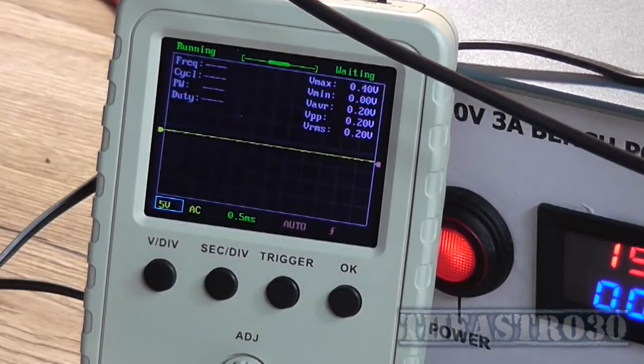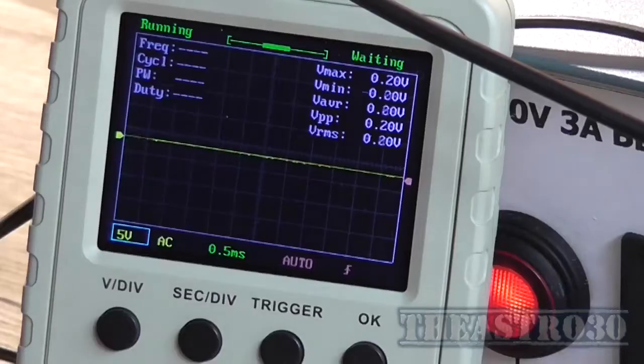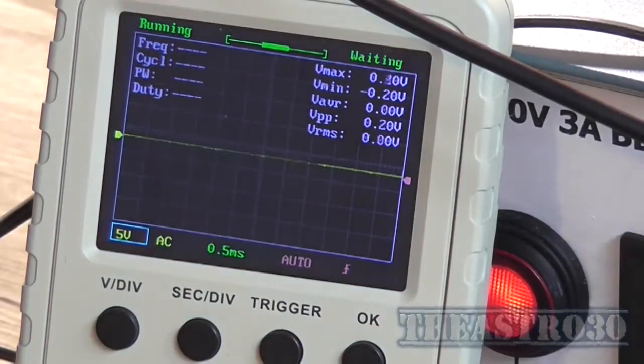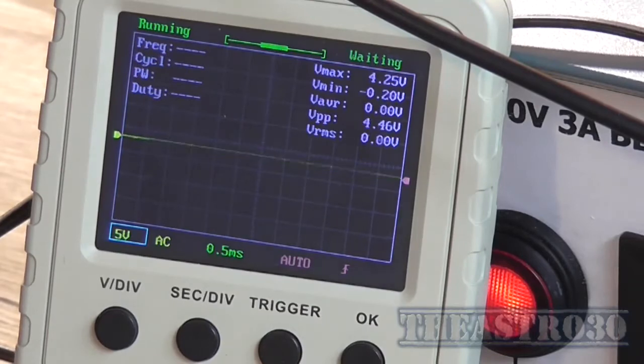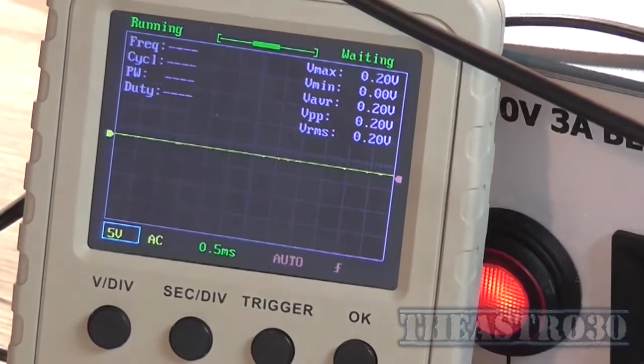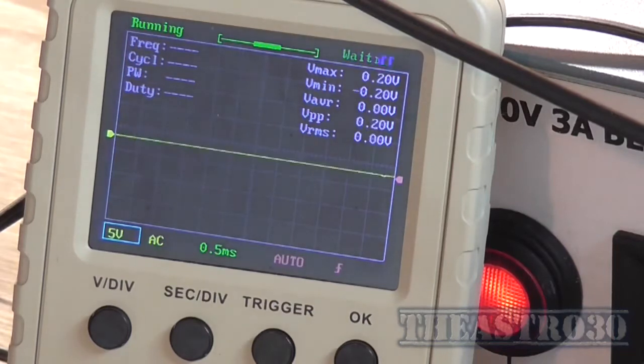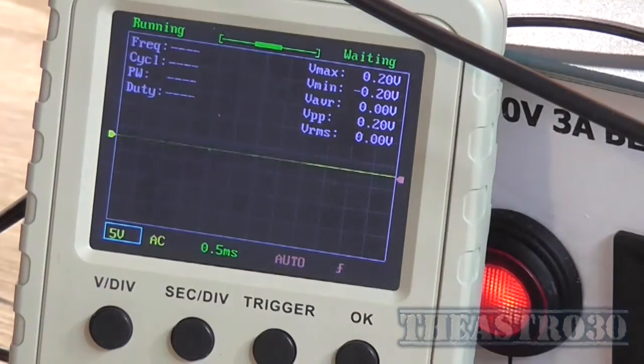Now, this time, I don't see anything on the output, and I have roughly 20 milliamps of current draw. Interestingly, there is no oscillation on the output that there was before. So that's interesting. I still can't see any output though with the burst test. So let me hook up the audio source.